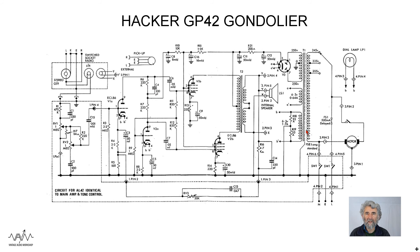Going to the power supply — something a little unusual for a record player: they have taken the trouble to centre tap the heater supply. They haven't centre tapped the winding itself but used two resistors across it, which is much the same thing. That's not normally done in record players, but by balancing the heater supply they get a lower hum figure. They have also provided a separate heater winding for the rectifier valve — I suspect it's an EZ80 — and although the EZ80 was intended for use on a common heater supply, it's still good practice to have a separate one should the heater-cathode insulation fail. So again they have added a little bit of extra cost to this unit which you don't get on the cheaper ones.